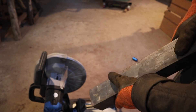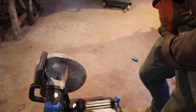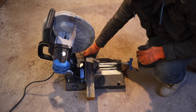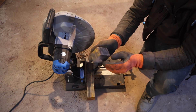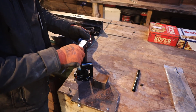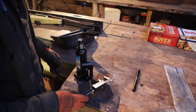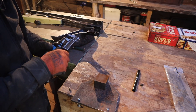I reckon we have a pretty decent chunk of this solid square bar. We'll drill a hole in it that's the same size as the cylinder. This little jack has a top of 27 to 28mm. I want to put a 28mm hole in that — let's go about 20mm deep.